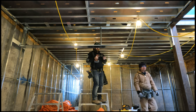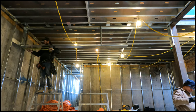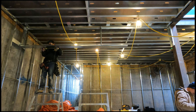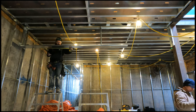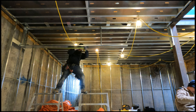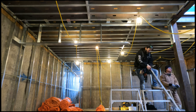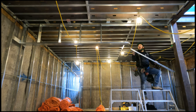I keep the front side up, check the back side with the laser, set it with a clamp, then check the front and set it with a clamp. I'm just transferring my layout down from the top — 16, 32, 48 — whatever I came out to on top, I come out the same on the bottom. While I'm in there I can do a quick measurement for the studs too. When I'm done with layout I'll try to pick one size that fits all, though some bulkheads are extremely sloped so you have to do different-size studs.